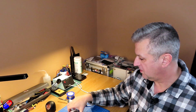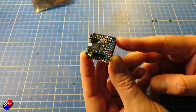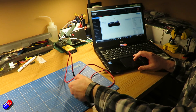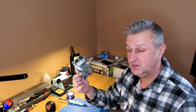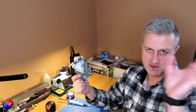So with all that said, let me jump to the table. This time we're going to attach everything to this Matek F411 WSC. An important tip: when you have a new flight controller like this, the first job isn't to start soldering everything onto it. The first job before you even warm your soldering iron up is to plug it into the computer and make sure you can flash it and it works. If you put the solder pins on or the wires and then it doesn't talk to the computer, you're pretty confident it's something you've done. Also, resellers won't accept flight controllers back if they're covered in snotty soldering.